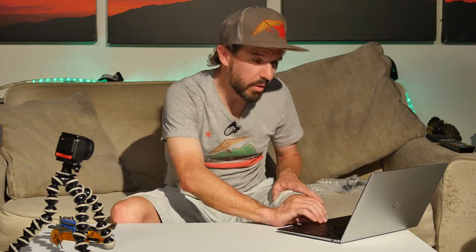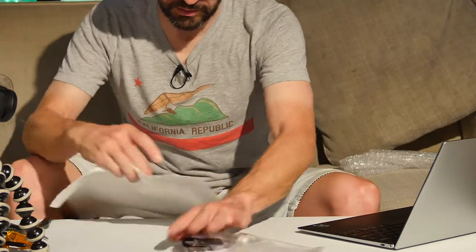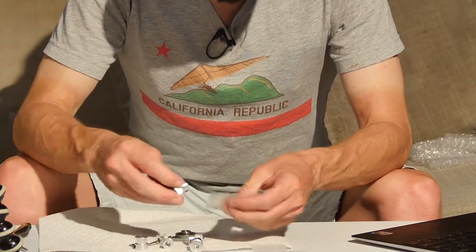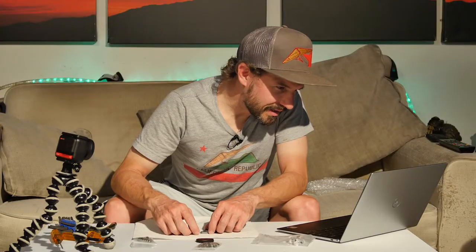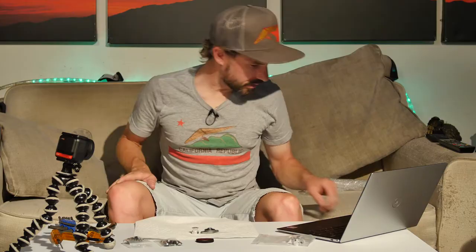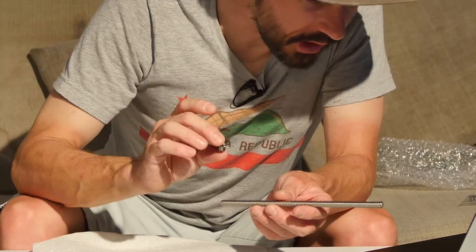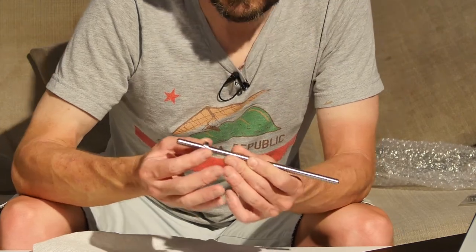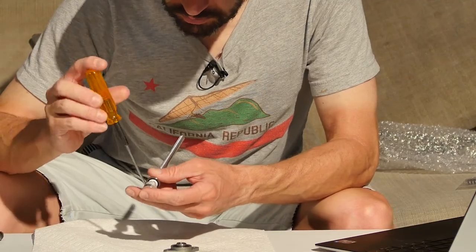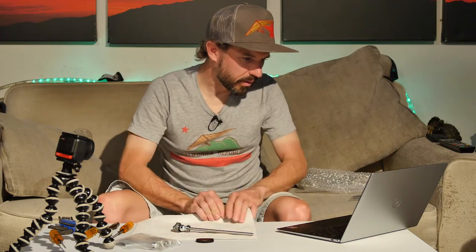So next is the Z motor assembly. Flange mounted bearing. Sometimes I like to wipe the oil off the outside of these parts when I work on them. I don't really want to get oil all over the place. A 20 tooth GT2 pulley. I'm guessing that's one of these. Z lead screw spacer. Where might I have one of the, oh, that was a printed part. Aha. Z lead screw spacer. So that all goes into a lead screw bearing, and you can see the direction of the flange. Then the spacer. Then my 20T GT2 pulley. Need to loosen some set screws. There we go. I'm not gonna tighten any set screws yet until I know exactly where I'm going and what I'm doing.